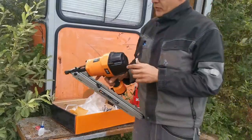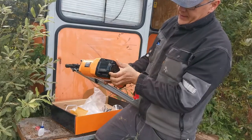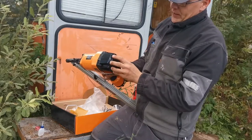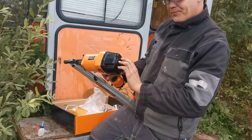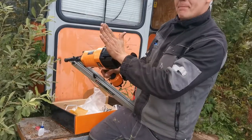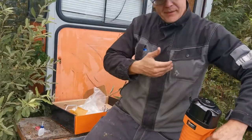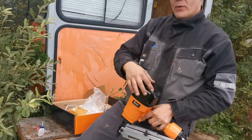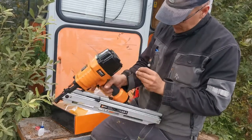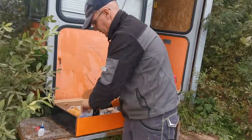For those that don't use air tools often, on the back side you have this plate. If you rotate this, it will adjust the port for the air. At the moment it's up, but when working from this side you don't want the air coming towards you, then you can rotate this where the offset is pushed.